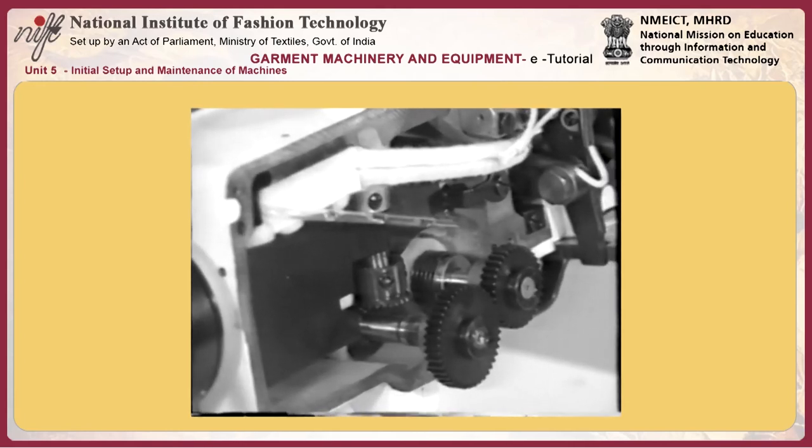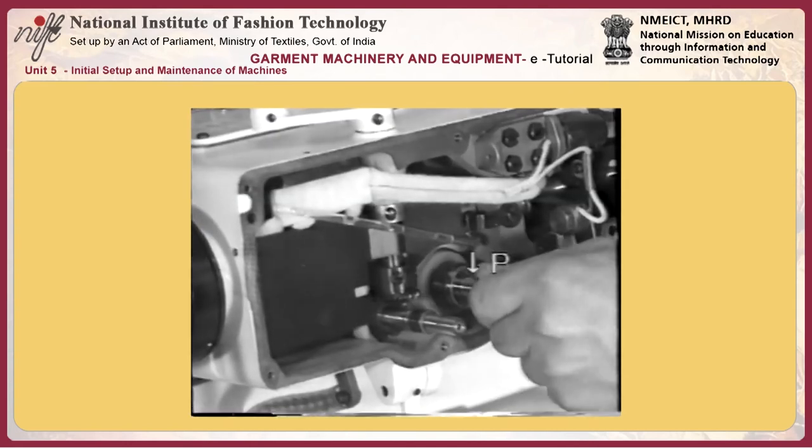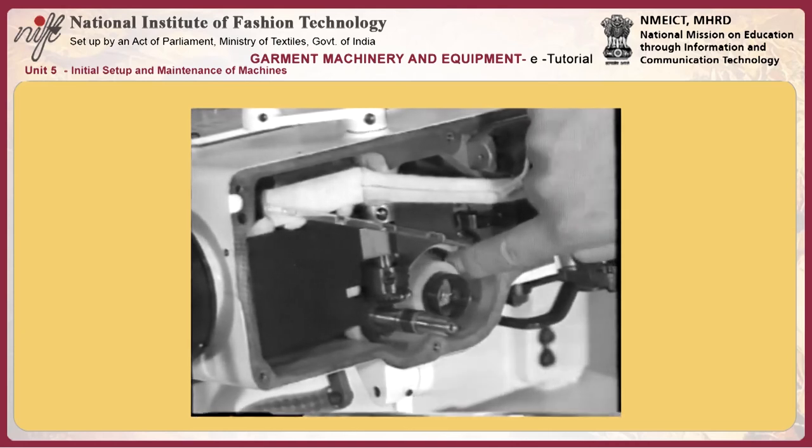3. Adjusting thread check wire A. Adjust the thread check wire so that it comes in contact with tension guide D of tension controller number 2 when knife stop lever B comes in contact with stopper pin C of the knife arc driving lever belt clamp.